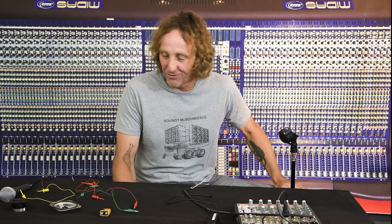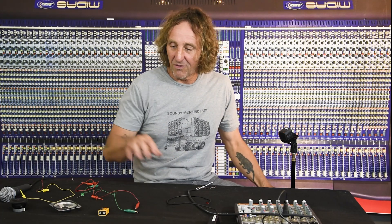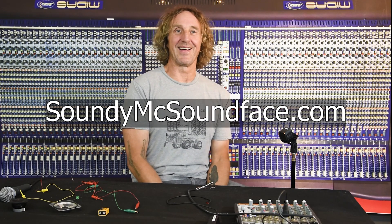In summary: which is more dangerous — 48-volt phantom power, 5-volt USB, or a 9-volt battery? If you're a piece of wire, the 9-volt battery wins, USB comes in second, and 48 volts is harmless. If you're a speaker, 48 volts doesn't do much; 5-volt does a good amount; 9-volt does more. If you're an LED, the 9-volt will really light you up. If you're a tongue, that 48-volt is going to bite you. And if you're a microphone, they're all about the same. Thanks for joining.